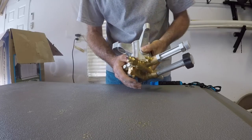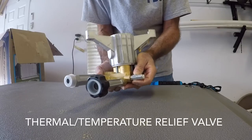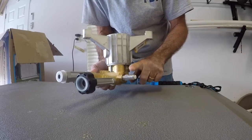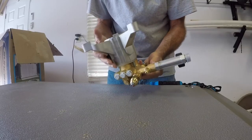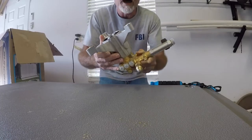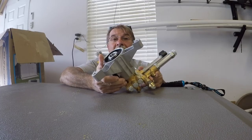The two options I was going to talk about earlier: you can replace all the parts inside here. Inside the base there are some little pressure-sensitive valves that know when you squeeze the wand, putting a demand on your pump, which causes your engine to rev up for high-pressure washing. There's also a fail-safe device so that if you get too much pressure built up the thing doesn't explode — it has something to do with high temperature. We're going to do a full install with this complete new pump assembly.